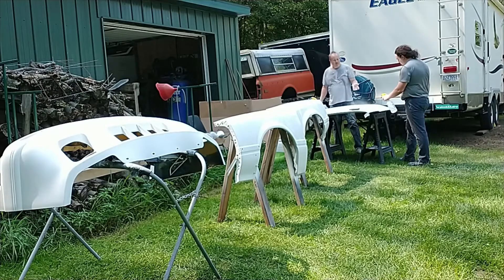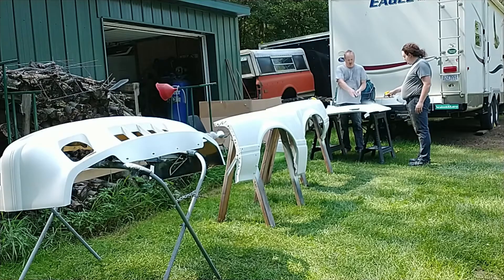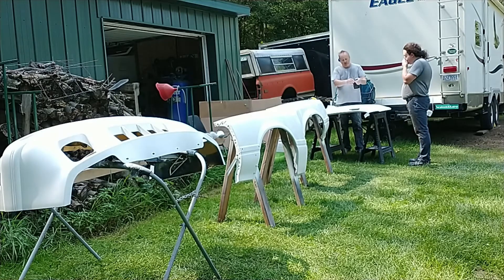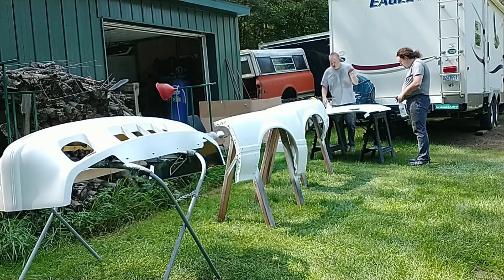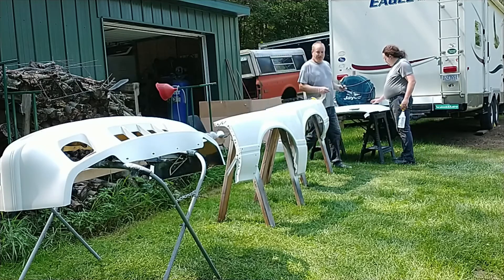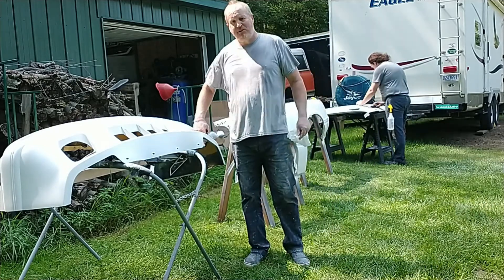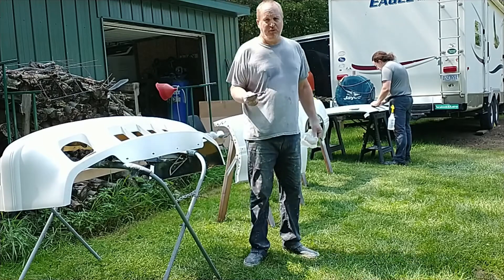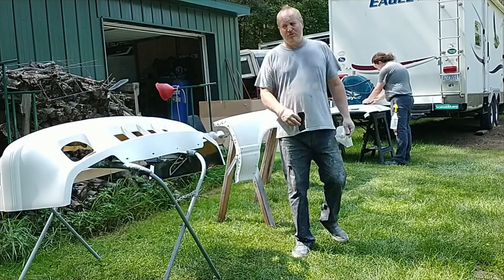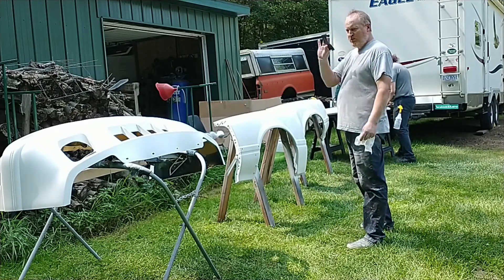By using the block you can handle it for a little hot second. You can take this section here, just tear off that part, then use that piece. That gives us a fresh piece of paper — we're going to drop this in the water. Even scraps like this can be used to get into tight spots in the corners, so might as well keep using it until it's completely gone. Once we're satisfied everything's been sanded so we can get a really nice finish, then we're done.